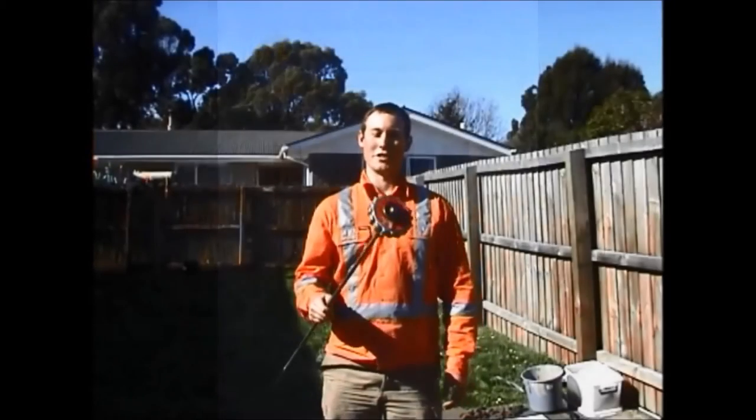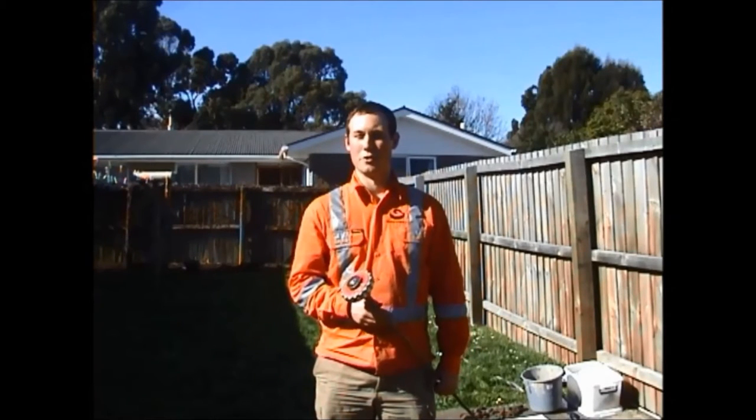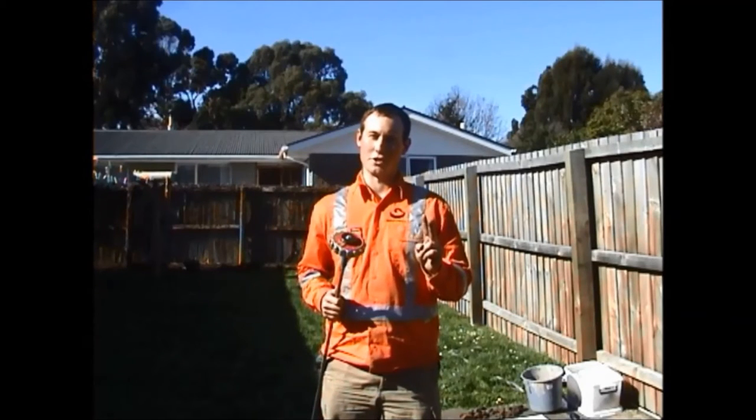When you use this, you usually use it down a borehole, like a hand auger. You can also use it at ground level. It's important that the soil is cohesive. For example, you do not use it in gravels and you do not use it in sands. When you take a measurement, you take two measurements. First is the peak and the second is the residual.